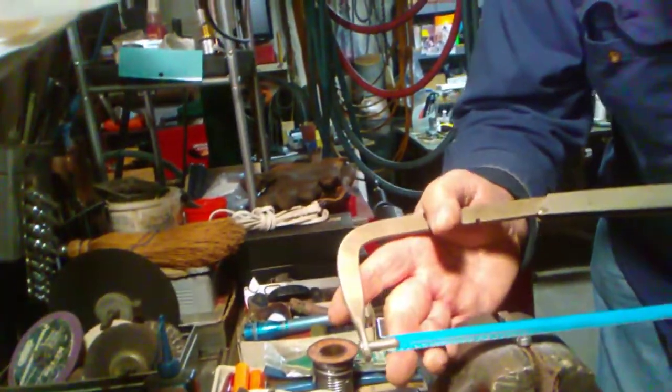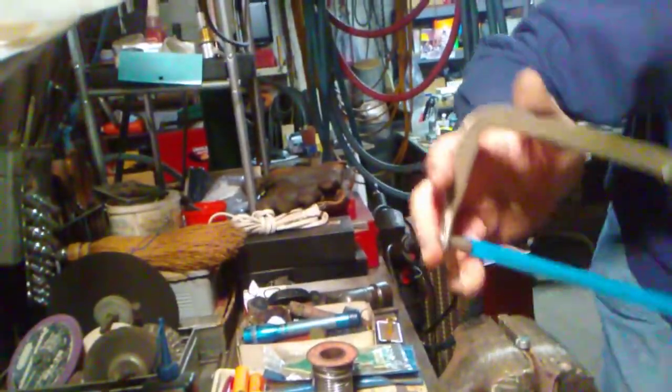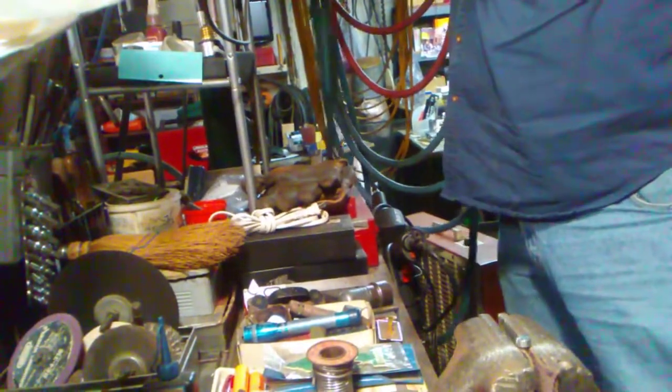All right, that's all the deeper I want to go. Now I want to go wider. Start at the absolute top. Shave it off a little over on the side until I get down to that same spot. Then do the other side, about the same. Yeah, really, one could stand a little more. Let's go more on this side. It's closer. I didn't quite hit the dead center. Like I said, this is just for example. This isn't going on no fine-looking British motorbike. Now, I need a 3-pointer file.